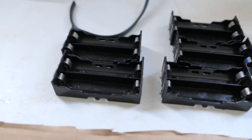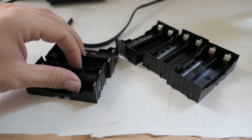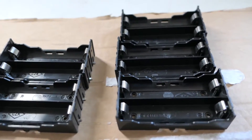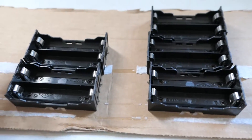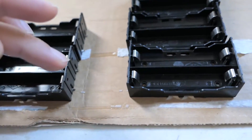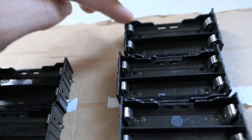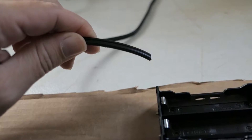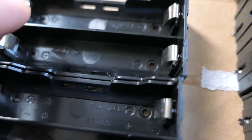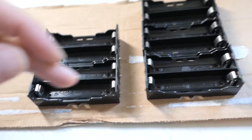Alright so the iron is getting hot and I bent all the leads here - they're all flat. So now what you got to do is connect them together. The easiest way to understand it is that you start with one side and you end out with the other side. If these were separated, which they will be on this build, if this would be positive it would go like this and then it'll jump to this one and keep going like this. This would be negative at the end of the run. I am using just normal lamp cord style wire which is 16 gauge.